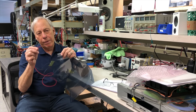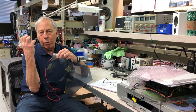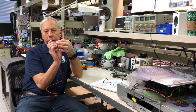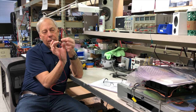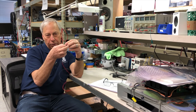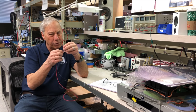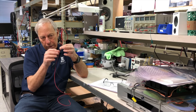But in the same way that these don't particularly like being really close to other conductors, shielding can compress the sound, can make it sound a little compressed. So when we built cables, one of the ways we got around that was by putting in filler made from a very low dielectric material, tubes in here, to keep that shielding away from the inner core. Normally it's just wrapped, and you asked about coax, which I'm not a big fan of, RG59. Not a big fan of those as interconnects, so I'd stay away from that. They'll have a big piece of plastic over here, and then a braided shield.